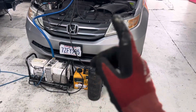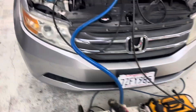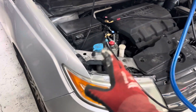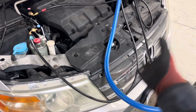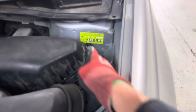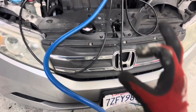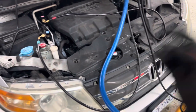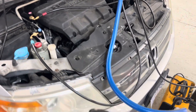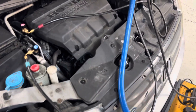It's been a long time since I did a vacuum purge and flush with dry nitrogen on a system. This is one of the shop painters' personal family vehicles, so I'm going to use him as a guinea pig because he just replaced the condenser. I condemned it back on 5/24 — he had a leaking condenser, a typical little dollar-size black oil stain with dust on it. He needed it right away to go south somewhere hot during the summertime, so I just filled it up. And just now he replaced the condenser.